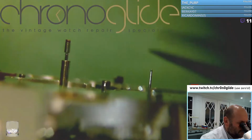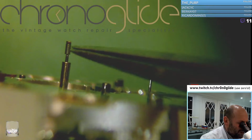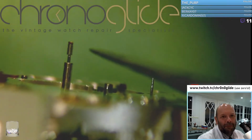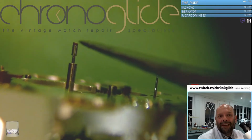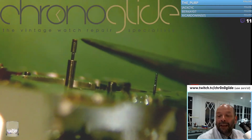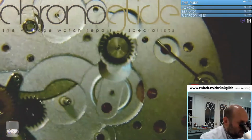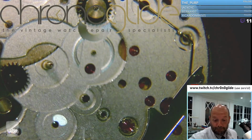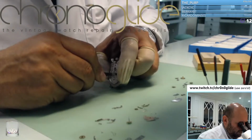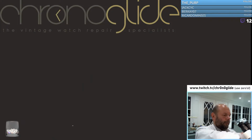And you can see a small recess here. So now I'm going to try to pick it underneath here and just pull it out. And this bit I can rivet back into the center second hand. So that shouldn't be a problem, and everything still stays original. There we are. Nice and controlled. Oh, sorry about that.